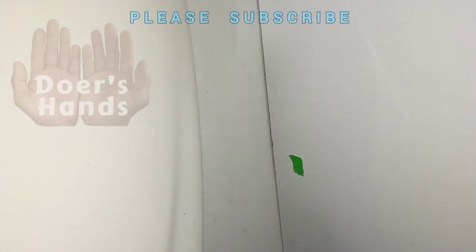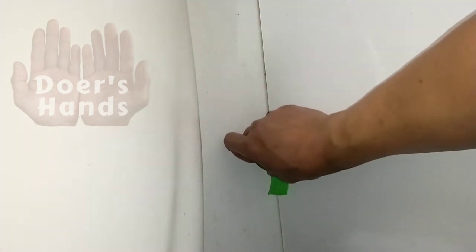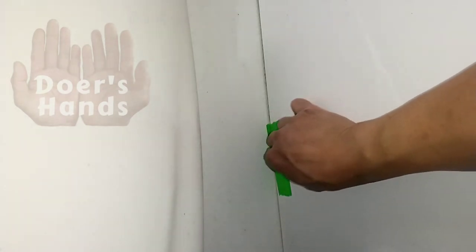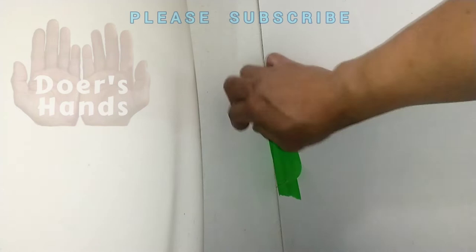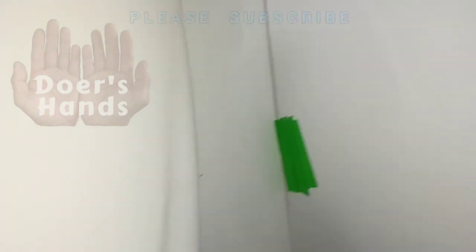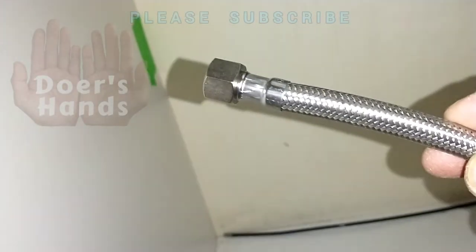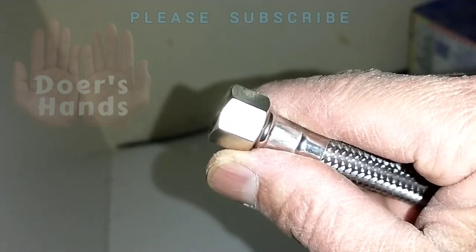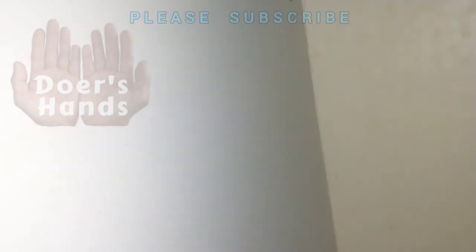We will make it bigger so we will not miss the hole. I don't want to cut the hole next to the edge because this is not pure wood, it's only MDF wood. Now we'll drill the hole where this fitting will pass through. The diameter of this, I measured it at 3/4 of an inch. Okay, 3/4 inch.